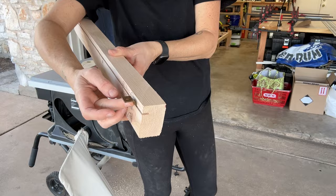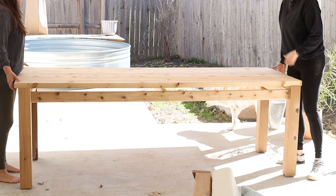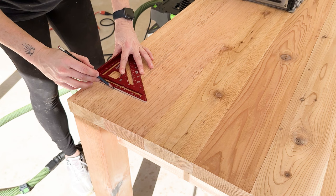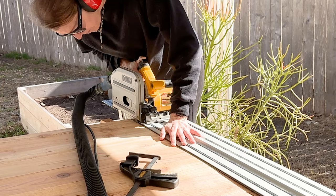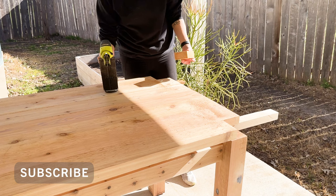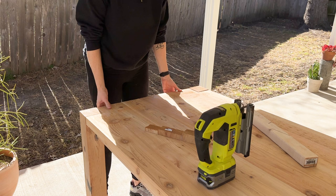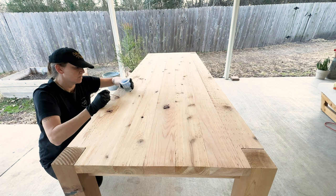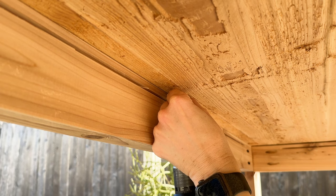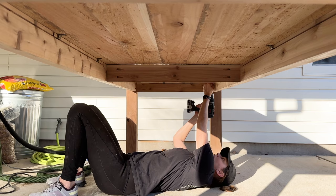With the top glued and out of clamps, I moved it to the top of the base. First I cut the table to length using my track saw — a circular saw would be just fine here too. I used a square and drew out the cut lines for the legs, cut along the lines with my track saw, and finished off the cuts with my jigsaw. With all four cuts made, I dropped the top onto the base. There were a few holes and knots on the top, so I once again used my TotalBoat epoxy and filled those up. I then used the Z-clips, which slide into the groove and screw into the bottom of the tabletop, so the top is connected but can still move with expansion and contraction as outdoor temperatures change.